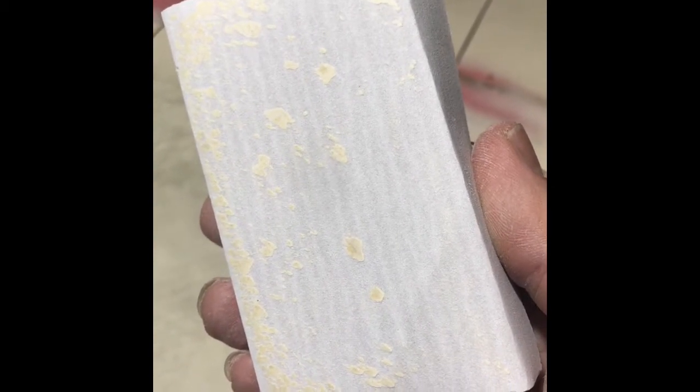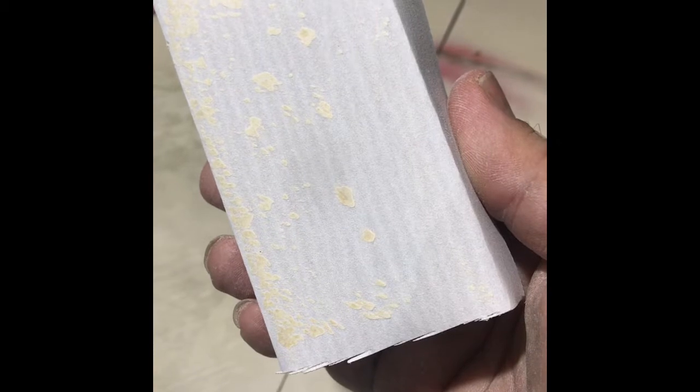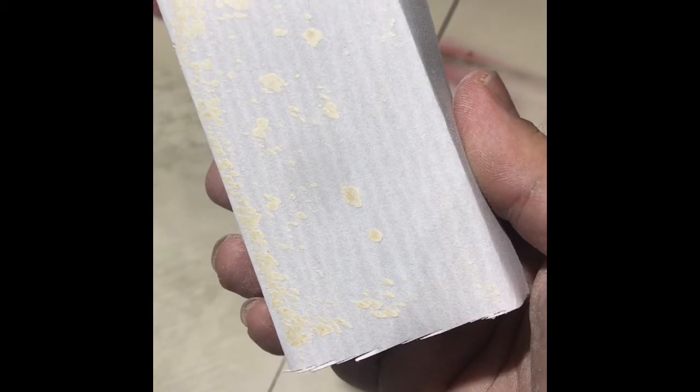Just a bit of light scuffing, and I can feel it already — there is some more friction on the sandpaper than I would expect. And there you have it. All those bits there are Amine Blush, and it doesn't take long and the paper is completely ruined and you're unable to use it any further. What I'm going to do now is to get rid of the Amine Blush simply by applying water and a scouring pad. From what I'm led to believe, that's supposed to get rid of the Amine Blush because it's water soluble.